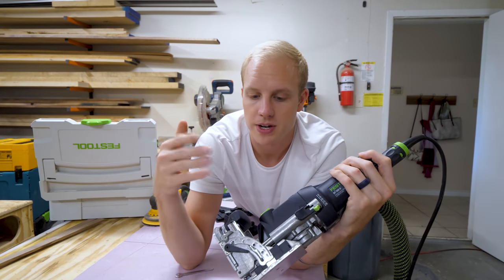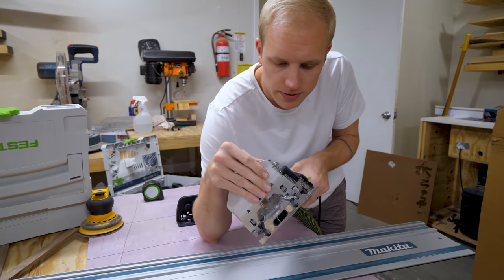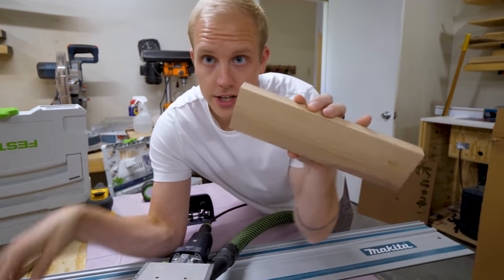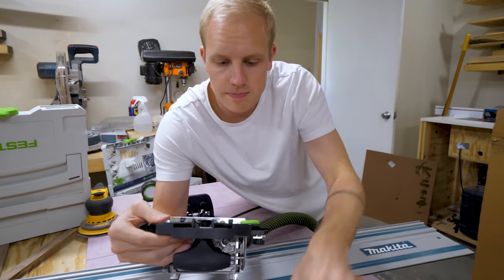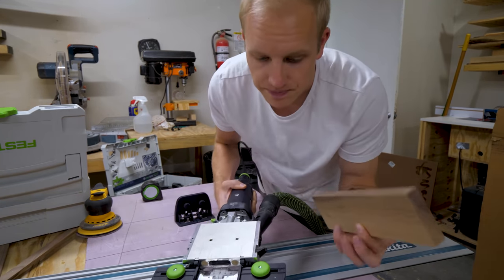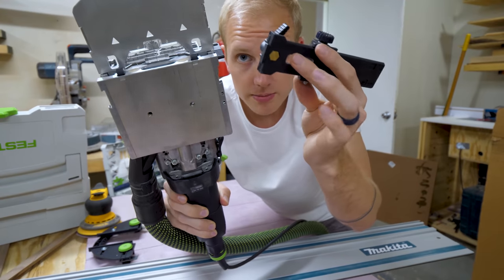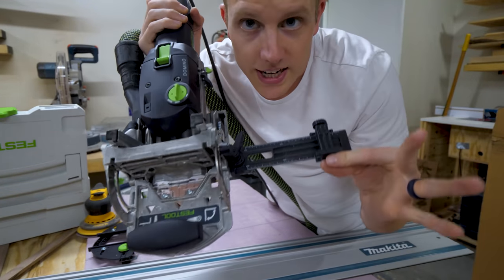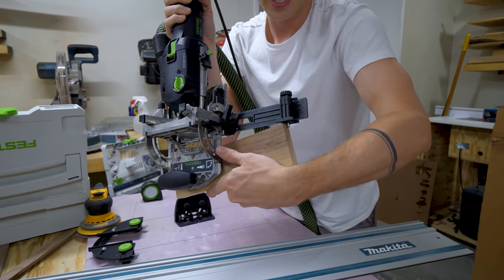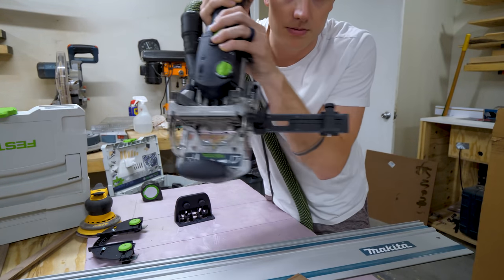And that's how I was planning on working on these consoles, but I want to see if any of these jigs helps me with that. The first accessory slips on the toe of this little reference gauge here, and what this allows you to do is reference the left and right sides off of these plastic pieces — you can put a tenon straight in the middle just by clamping in there. The next accessory has these little dovetail slots in the base plate. There's a little pin that can index the last hole that you made — on a long piece of plywood you can stick this pin off the edge and measure in a certain distance, or put the pin in the hole of the last one if you're doing a bunch at common intervals.